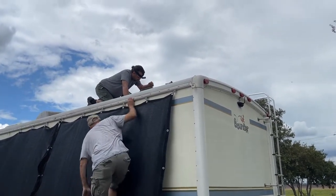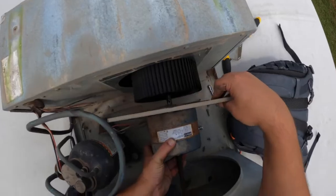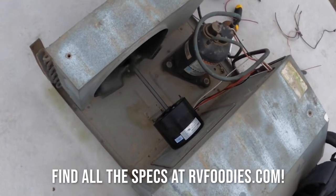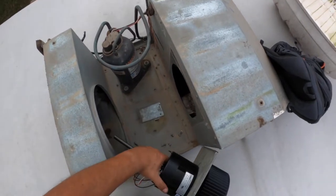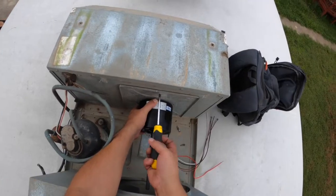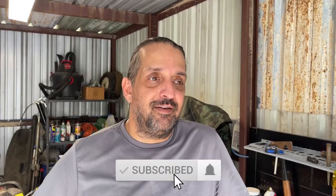Let's review - that wasn't too bad of an install. Those air conditioners are 21 years old and the motors are the original, so it really wasn't too hard. Now I've replaced both of them. The motor wasn't the exact motor - I couldn't find the exact one. The only difference is the first motor was 2.9 amps and the other is 3.4 - 0.5 of an amp doesn't make a difference. Other than that all the specs were the same. We'll put the motor link in the description below - the capacitor comes with it. It's a really easy fix, very inexpensive, and you can do it with very little know-how. Part of the problem with RVs is things breaking and you have to fix them. Thanks for watching - if this helps you, give us a like and subscribe.